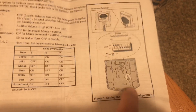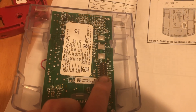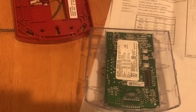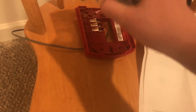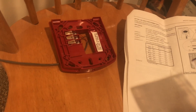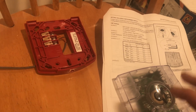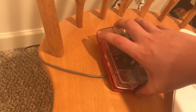You can see the DIP switches are located on the back of the device right here. We will be doing an all-tones test today. I'm going to try to do as much as I can one-handed but some of it might require two hands. I'm going to set the tone on each and then clip it on. The first one I've set up is chime — this is going to be its continuous pattern. I'm not coding anything through the panel; I'm just running it on straight 24 volts DC.